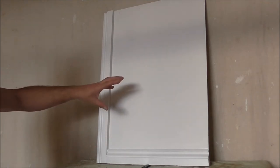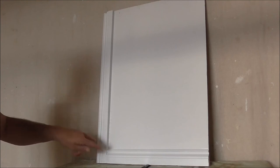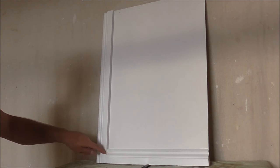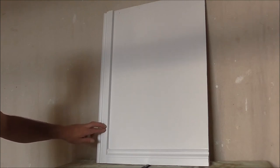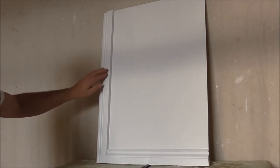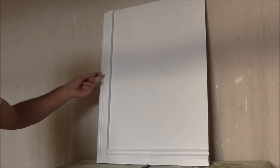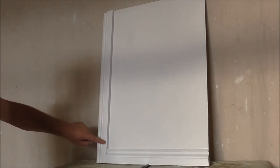This has all had a second coat now. The board, skirting and the architrave. Now, with the architrave and skirting, being a different paint, a different makeup than what's on the walls, this will bind with the paste and become more resistant to working up. But because there's been a layer of paste on, you won't have keyed the previous surface coating. So when you apply your water-based paint, it works it up, binds with the paint that you're using, and then leaves big streaks which won't really come out.